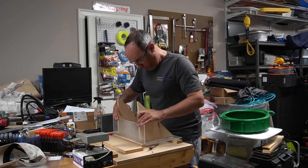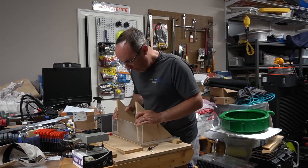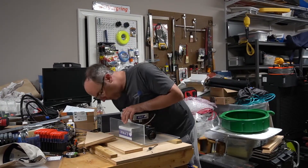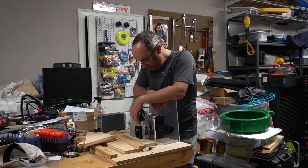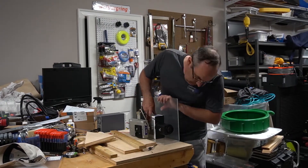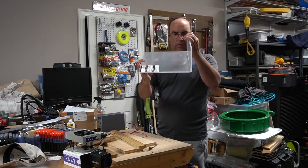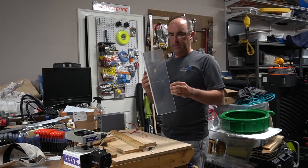You can see I'm doing the first bend — it was on and heating up for about 4 or 5 minutes. I've got blocks with a nice 90-degree angle to put the acrylic against. I tested it out with the camera to make sure everything fit nicely, and I was pretty happy with the fit overall. We got a really nice, super sharp bend — really happy about it.